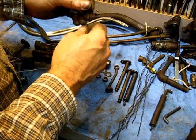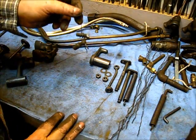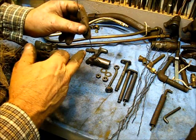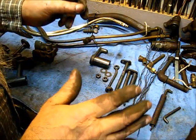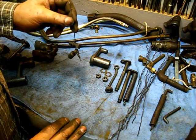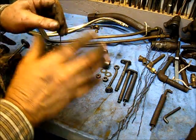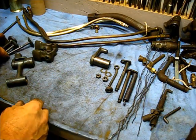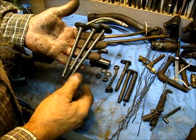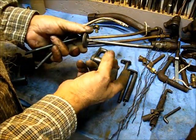This process compared to sandblasting — I don't use sandblasting. I know about it, have done it in the past, and I just don't endorse it as a go-to way to clean rust. Because that thread right there, if you sandblast it — sodablasting, glassblasting, oatmeal — most any blasting media you use, it's the process. It will remove some minuscule amount of metal. The valves we put in there — any of these valves aren't any good, they were rusted so bad — I wanted to use them as an example, so you can see they're really clean, enough to use a micrometer on them.